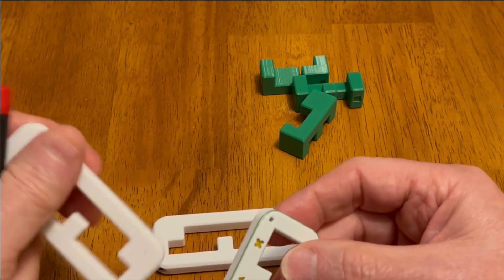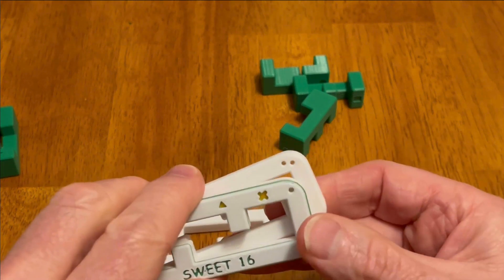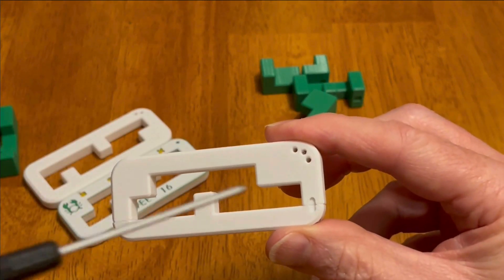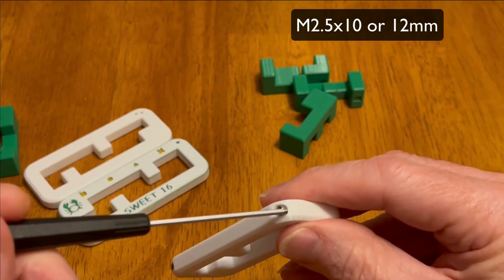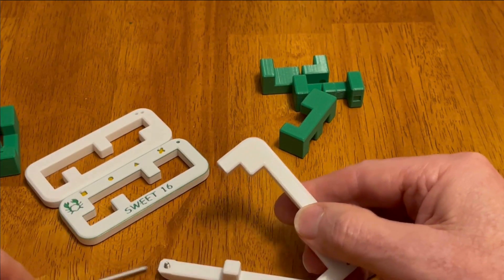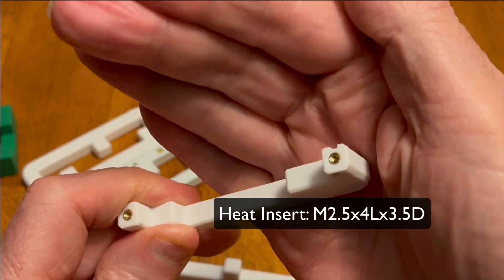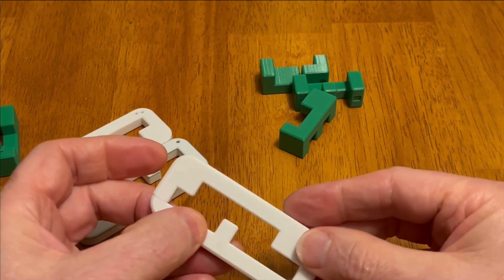I've also put holes in the plates so you know the position of where those plates go — one, two, or three — and you simply line those up underneath each other, and that's the position that those three plates should be in. The third plate comes apart, and there's a little notch at the bottom as well to show how that bottom piece should be attached. You can attach it with screws using a heat insert, or there's a version where you can screw it into plastic, or you can just glue it if you don't have screws.